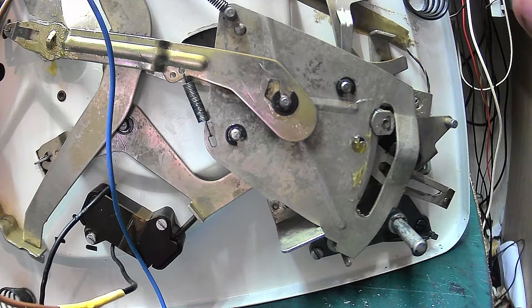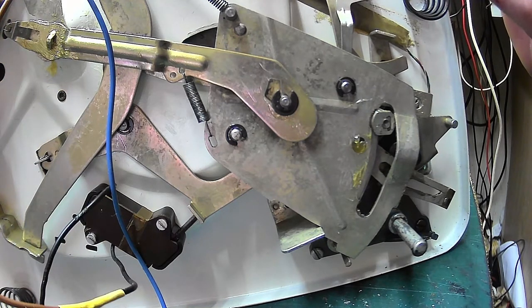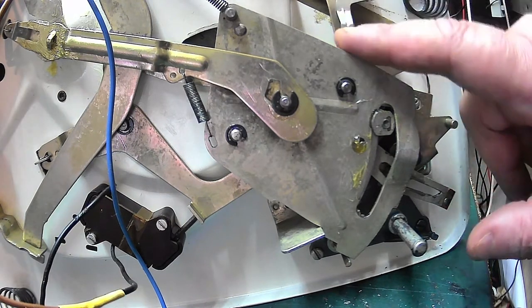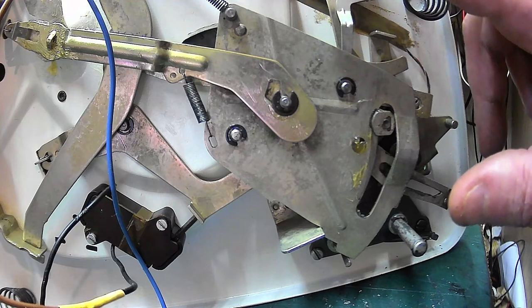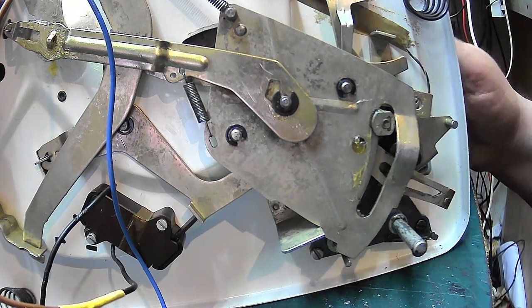Of course, the SP25 Mark 1 doesn't have the facility for the arm to go over on its own, because it's not designed to be used like that. But everything after the Mark 1, the Mark 2, everything SP25 and some of the other models, they all use the basic mechanism that I've just shown you on the SP25, and this is basically the same mechanism. All that's missing is that part there and a spring. You could, in theory, if you could anchor the spring, turn this into a single play. But why would you want to? But it is possible to do it.